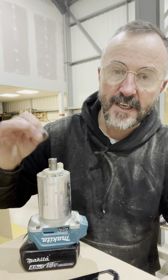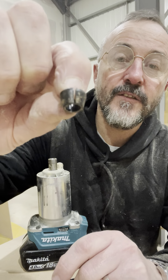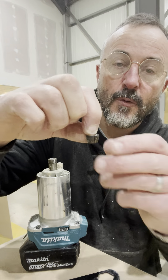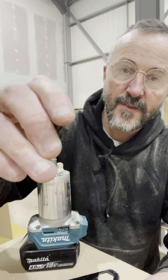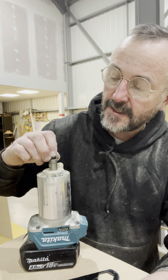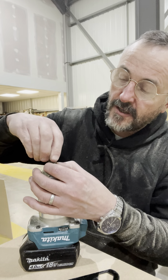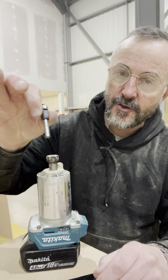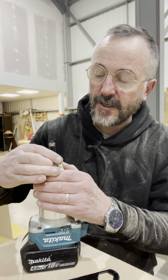All I need to do is take this collet out and put the correct one in. Make sure you put the tapered side in first — as you can see, it's tapered. The tapered side needs to go in so that as the nut clamps down on it, it'll tighten and grip your bit. The other collet is a slightly different shape but same principle — tapered side down. Then take your locking nut, start that off, and the smaller flush cutting bit goes in with a nice snug fit.